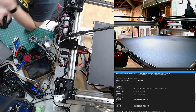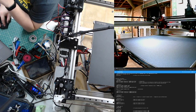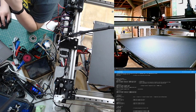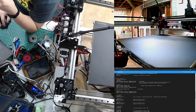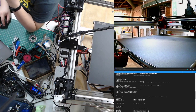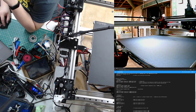Right, and I could space them off. Well, they need to be. With the coupler design that you've got, they need to have a centimeter between them. It's quite a bit. Okay. Well, you've got a 7 to 9 millimeter thick polymer spider in there, and for it to work, it can't be compressed except by the wings. So for it to do what it's supposed to do.